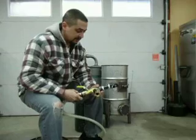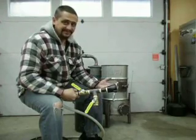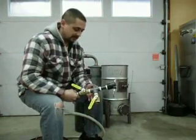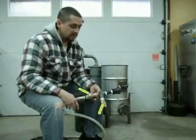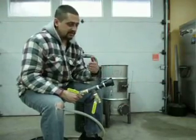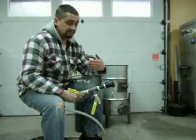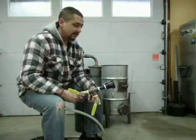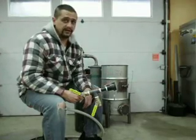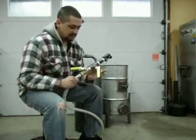It doesn't have to be that way. Any way you can figure to cut a hole in your air filter housing and plumb in that male fitting works. Some people completely bypass the carburetor and just build a little plate and bolt it to the intake. I didn't do that because most generators have their own load sensor — depending on how much power you're pulling, they give themselves more or less gas to keep power stable. My generator has that feature, so I left the carburetor on even though there's no fuel tank or fuel.